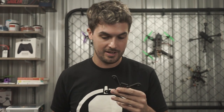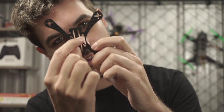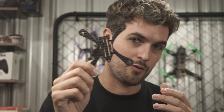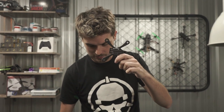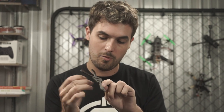The first step is mounting our stack to our base plate. Looking at the base plate, you've got a bunch of holes. The inside holes are a 16x16 bolt pattern — some newer compact flight controllers and ESC stacks use 16x16, so this frame supports that. The Diatone stack we're using will use the outside holes, which is 20x20. Still very small but a little bit larger, making things easier to work on. The holes for 20x20 are three millimeters in diameter, so you can fit an M3 screw.